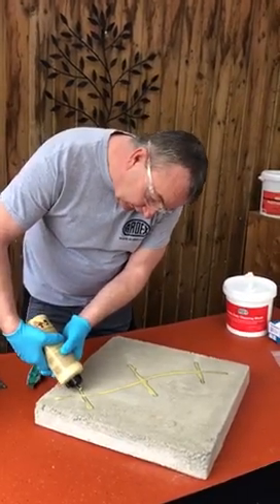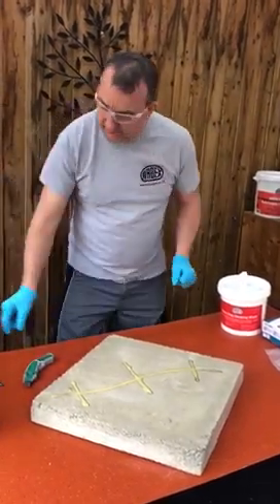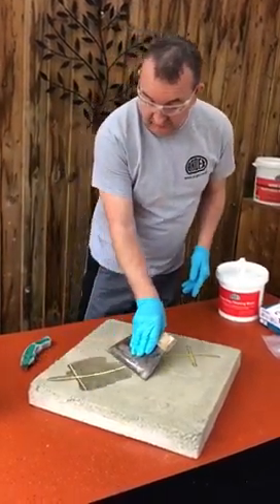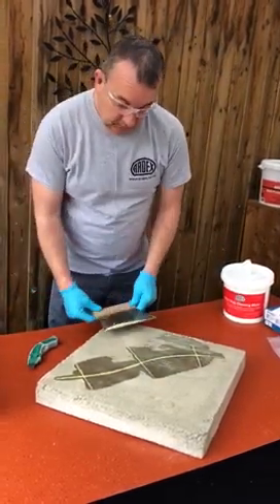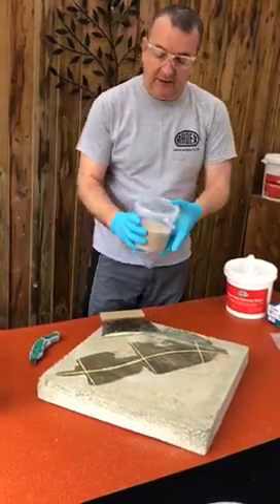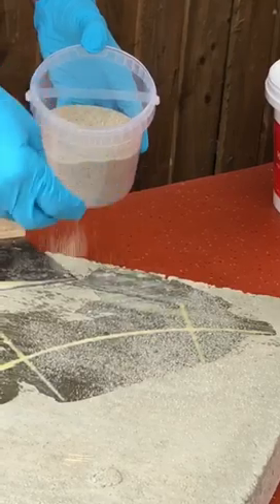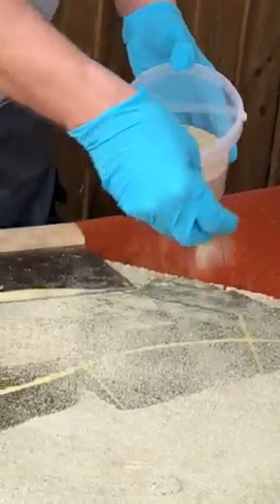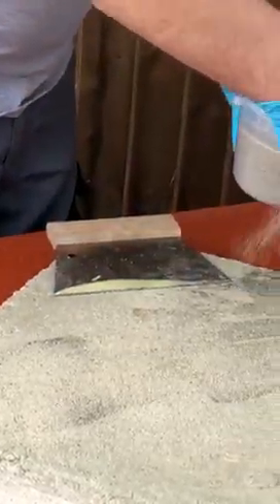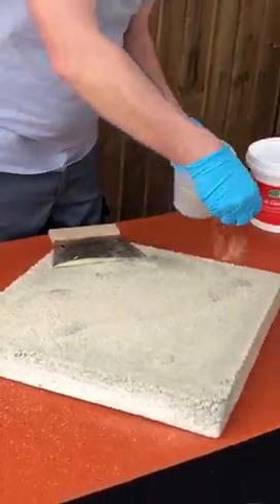As you can see it's gone in nice and clear. Once the crack is fully filled, use a flat blade — a paint scraper or flat-bladed trowel — and just flatten it off. Then apply a little bit of fine silica sand over the surface. The reason we do that is so once it's gone off we get a good mechanical key for the smoothing compound or damp proof membrane going over the top.